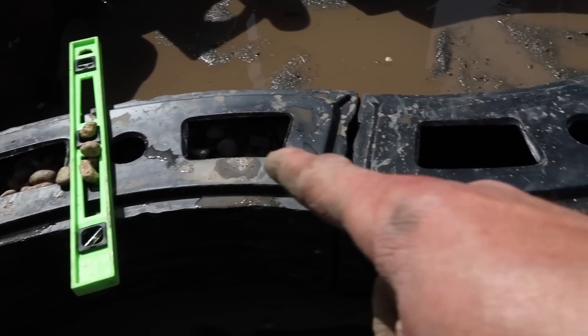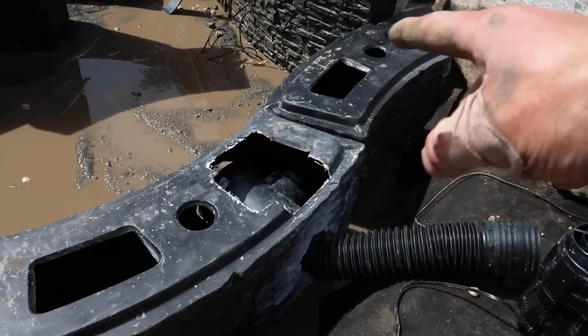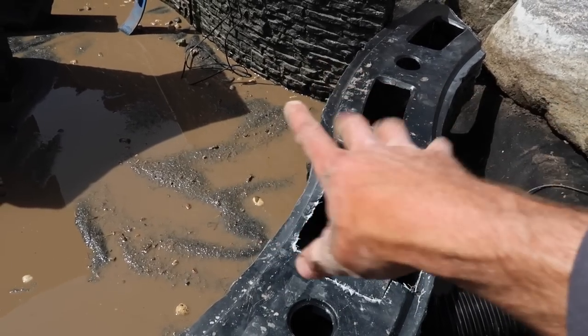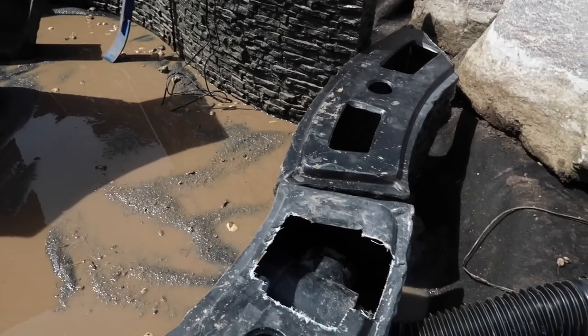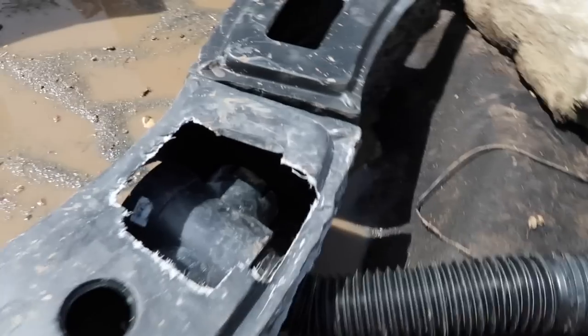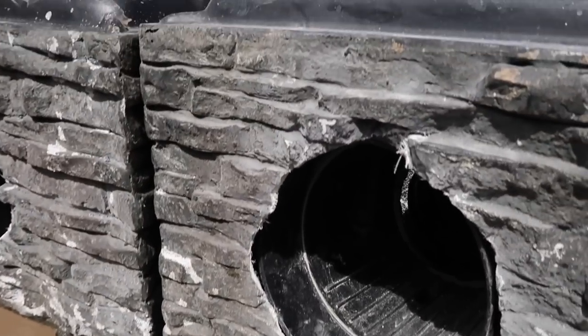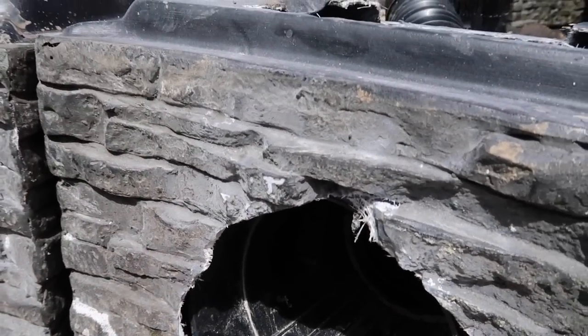Basically, the way we want our stack slate walls to go, they're going to curve back in there. We'll probably get a little rock or something down in there just to help hold everything up and to transition really nicely. But you'll notice that these don't fit perfectly together, and that's okay. You'll never ever see that joint. What's most important is that joint along the front. So we still have to make sure that everything matches up.